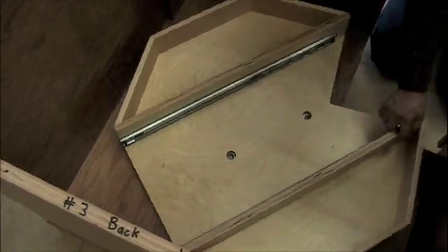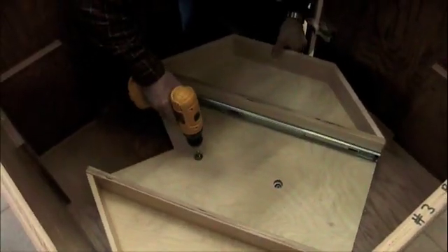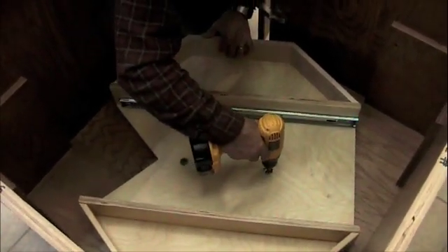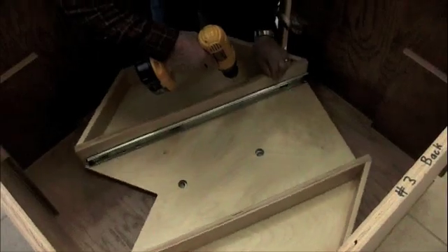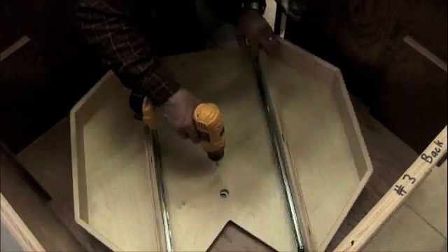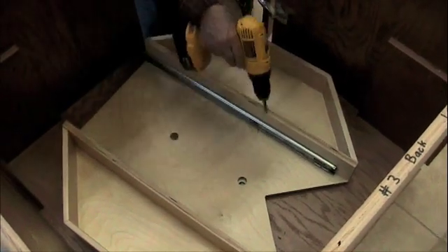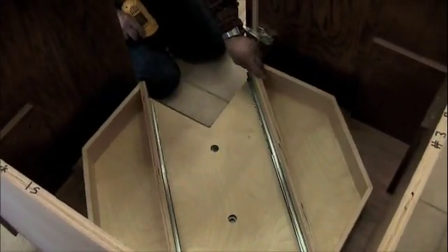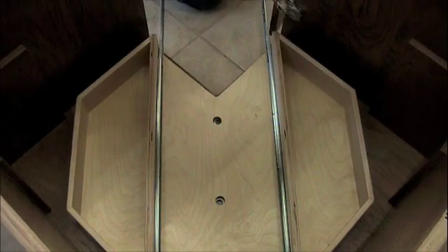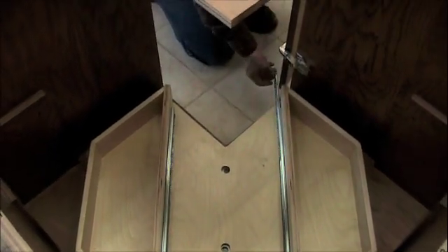At this point, check the rotation. Rotate it to find the next access holes or screw holes in the front. Continue around and attach all the screws. The modules come with an indent on them which locks them into your centering position so the slides will clear the door. If you have face frame construction this will obviously be wider. The modules are set up for either face frame or European style construction.